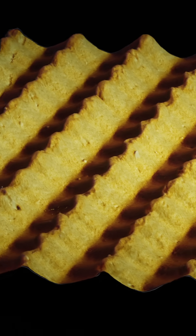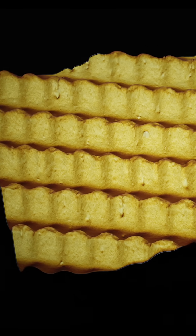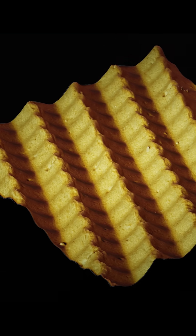Inside the groove we can see small dimples and valleys. The disc itself is conductive, using a carbon-filled PVC material, and the stylus contains a small electrode at the tip. This means the electrode is separated from the conductive disc by a small height, and this forms a capacitive circuit.